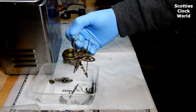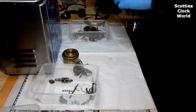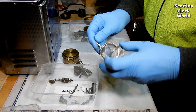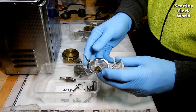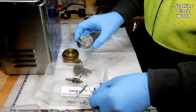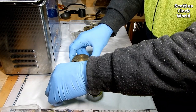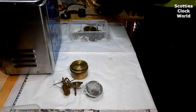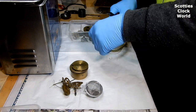That's the parts all tied up. Now the next step, we're going to use an infusion tea strainer to put the small parts in that will be easily lost into the bottom of the ultrasonic cleaner. The basket of the ultrasonic cleaner is made of 10mm mesh wire, and small parts and nuts that hold the two plates together can easily fall through because they're much smaller.